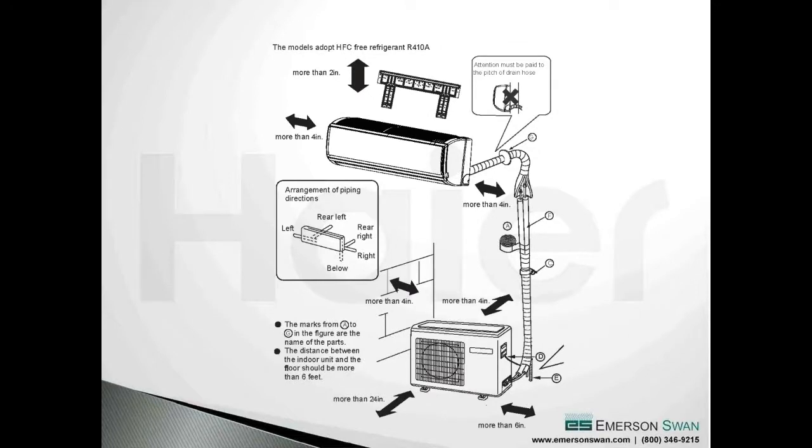Basically, this is what we're talking about - an outdoor unit to an indoor unit in a one-to-one configuration with line sets, wire, and drain running between the two. The moral of this slide is that we want to locate the indoor unit within the manufacturer's specification regarding line set length. All manufacturers will have a minimum and maximum line set length, so we position both units within those parameters.